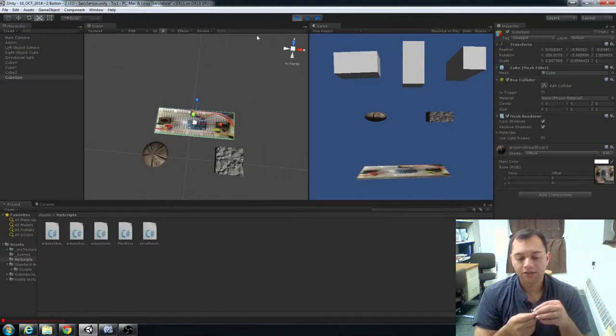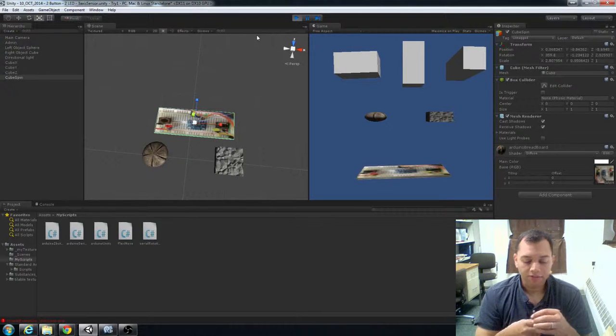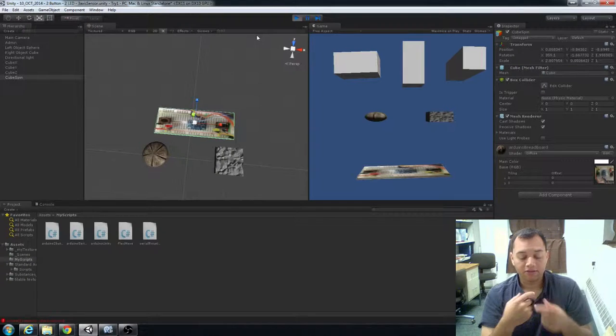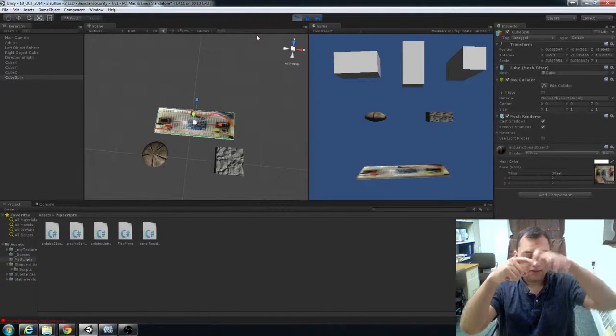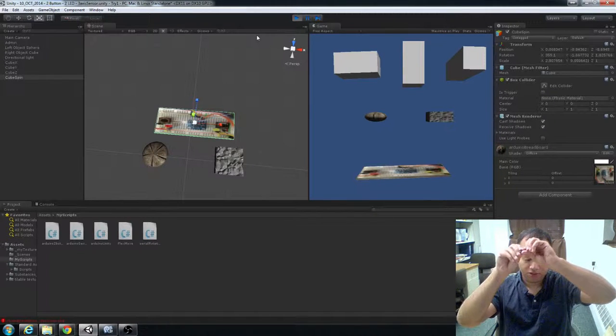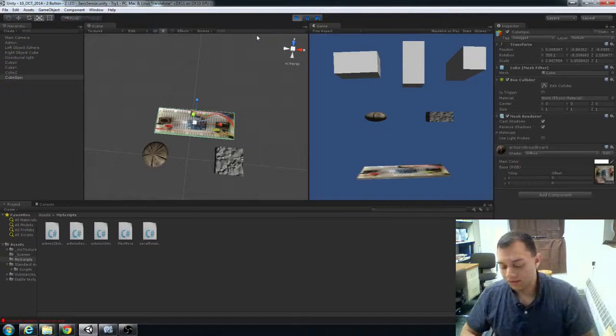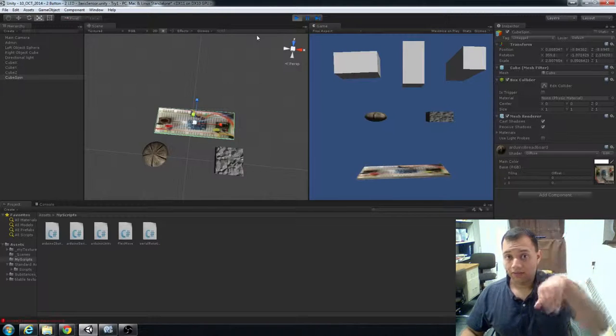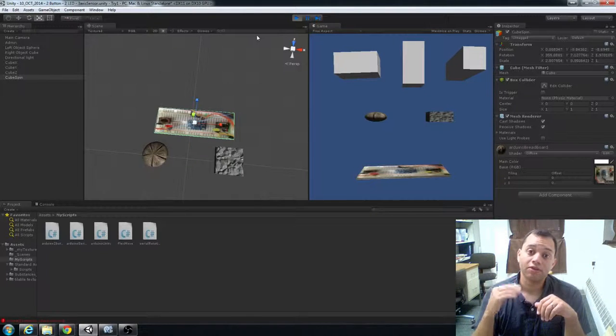And essentially what it does is increase or decrease resistance depending on when you rotate it. It's kind of like a volume knob. What I was thinking about doing was mounting this to the knuckle with a glove, and then having something that parallels my finger joint attached to the rotation of this potentiometer, which you can't see because it's super small and the video's not high quality. Anyway, if I have the point of rotation offset from my knuckle, then as I move my finger up and down, it will also move the rotation of the potentiometer,